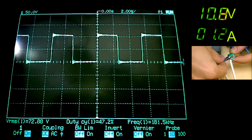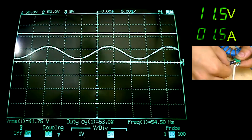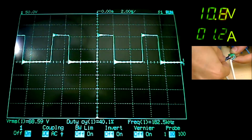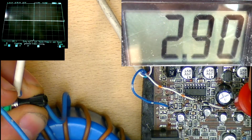And lo and behold, yes! We have full control of the output duty cycle and therefore the floating midpoint which the sine wave oscillates between. It was a fantastic feeling to find this and to see the duty changing with my input after so many hours of wondering what's going on. So good. This will allow us to calibrate a perfect resistor value to replace these with once we've decided on our final rail voltage.